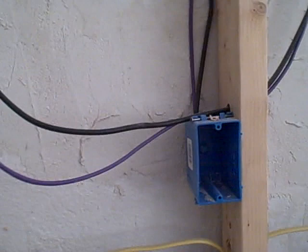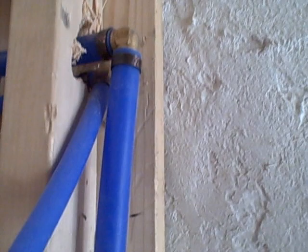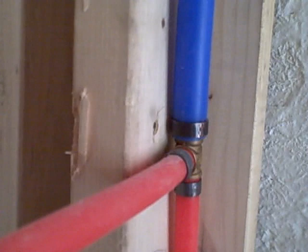And this is just wire here that I'm going to pull through once I've hung that area. For the PEX, I actually ran both in blue to save money since I bought about a hundred feet of blue. But from where it branches to half-inch from three-quarter, I used red for where it's hot. The two hot runs — one goes to the main sink and one runs to the dishwasher down here, which I haven't run an elbow for yet.